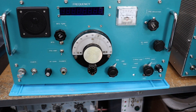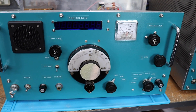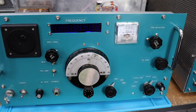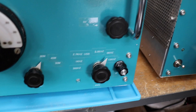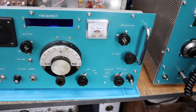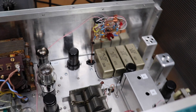Here we are back in the shack after that nice brisk walk, and this is my latest creation — a three-band Superhet which can receive SSB, CW, and AM. It's got a digital display, a number of filters from 300 Hz to 15 kHz (some of which work better than others), and provision for headphones and external speaker. Generally quite good — that's the top part of it.